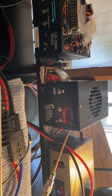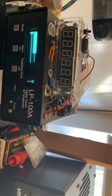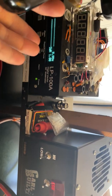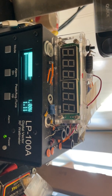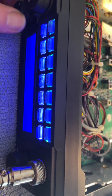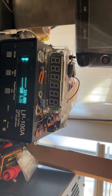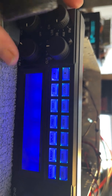On AM, you want about a 40 to 50-watt carrier at the most. I've got the mic gain turned up more on AM. She's working. Going to sideband — amp draw is about 35 amps. Put it back to AM, set the carrier back to 50.